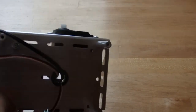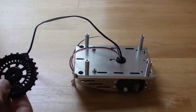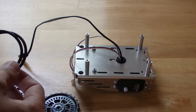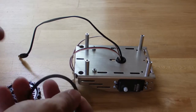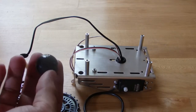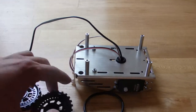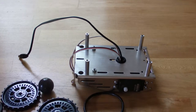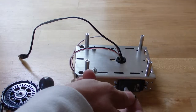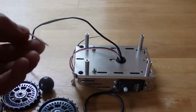Now it's time to get some wheels on here. We're going to take the partially assembled chassis and get the plastic wheels, which have some rubber O-ring tires for grip. We're also going to need a follower ball for the rear — a ball caster is better at turning in multiple directions where wheels are really made to just go straight. We'll also reuse the screws we removed from the servos when we took the control horns off, and we'll need a cotter pin.